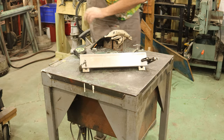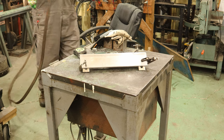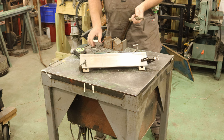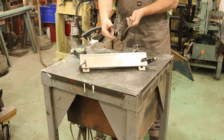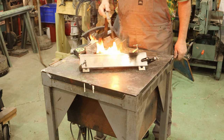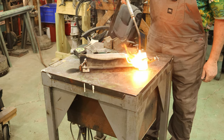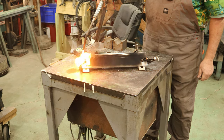Now what I'm getting ready to show you here is what I learned a long time ago. I've got an oxyacetylene torch here. You want to soot it up. So if you just turn the acetylene on... Oh my God, that's hot. Nothing but acetylene here. It's all about the acetylene. So you see I'm sooting this up like this? Turning it black.